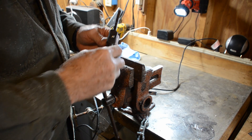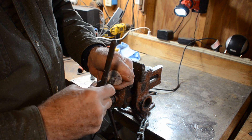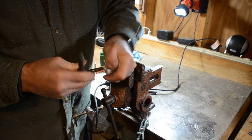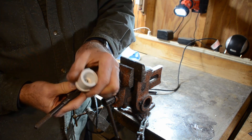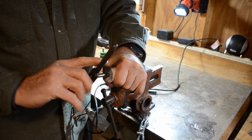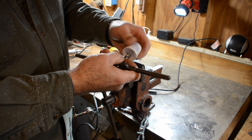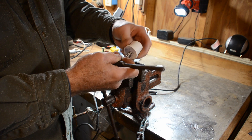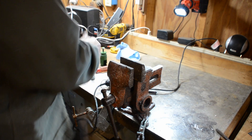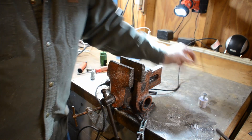I've got a T-handle. I'm going to put my tap in there, line up the flutes, and tap it the rest of the way by hand. You can see the tap starting to come through. With PVC, you don't need any oil — it'll lubricate itself. Let's check it and see if it works. There you go, it's nice and straight. I'm going to turn you off and we're going to go back and see if the glue is set on the other piece.